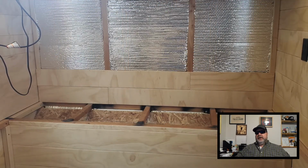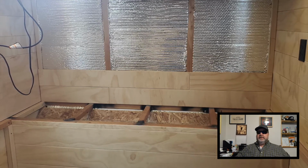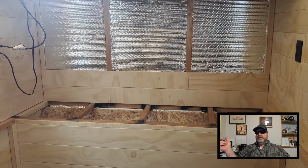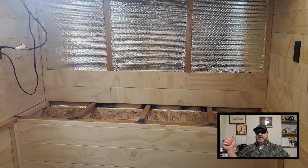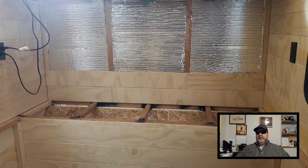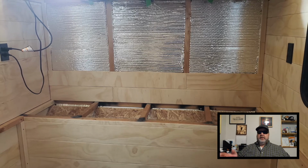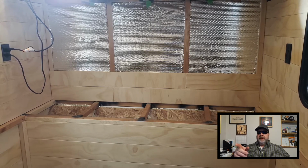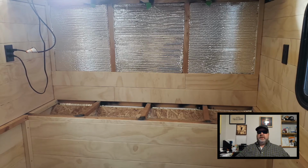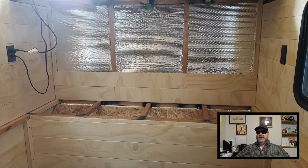Okay, so I've just about run out of the long panels. I have 2 more 8-foot panels that, in this section, since it's only 6 feet wide, would go the whole length, which would look nice because there's no gaps or seams. But I don't have enough to do that, so I'm going to save those. And I have a lot of 48-inch pieces that I can use here, so as long as I make my cutoffs right at where the studs are, then I should be fine. And those are 2 feet on center, so the 48-inch panels fit perfect.